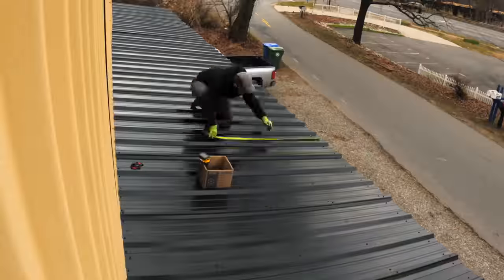Thankfully, the solution was pretty simple. I realized I could just go up into the attic and jam a few scraps in between the framing and the siding to give me more room to tuck the trim under the siding, and I was actually able to pull the piece up behind the siding from inside the attic. With that finally done, I could get the trim lapped over the previous piece, adding a few beads of caulk to seal the overlap, and then get the trim set in place and reattach the screws from the framing phase of the porch project.